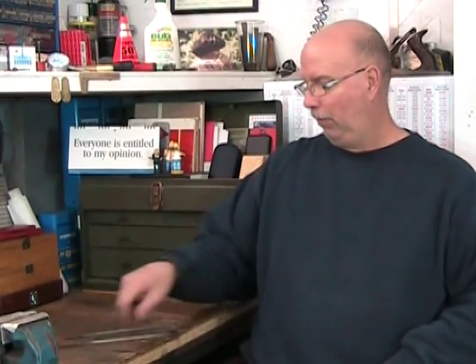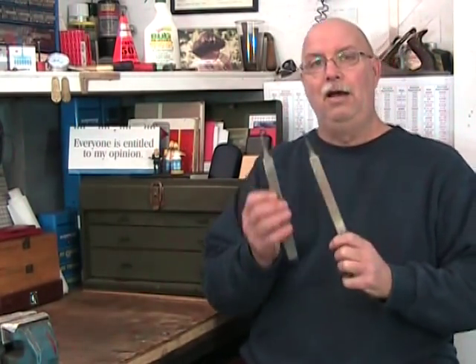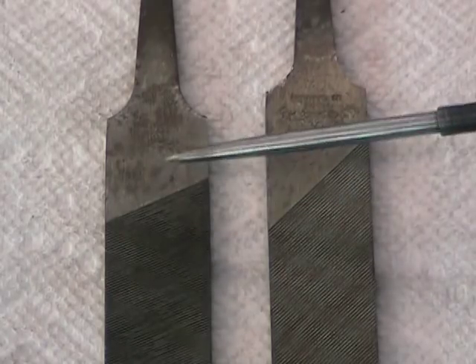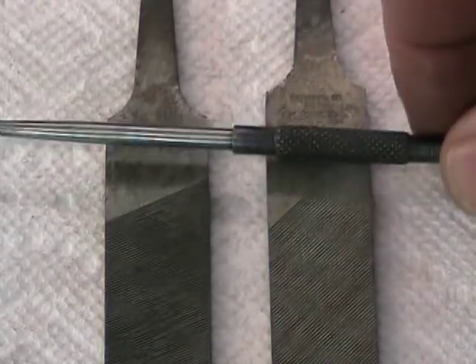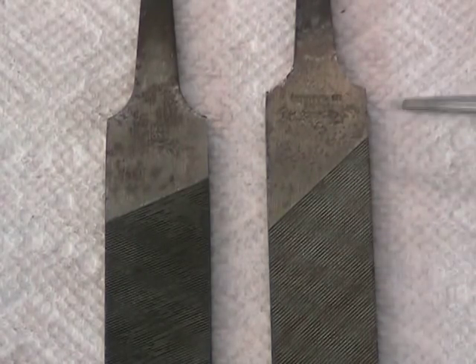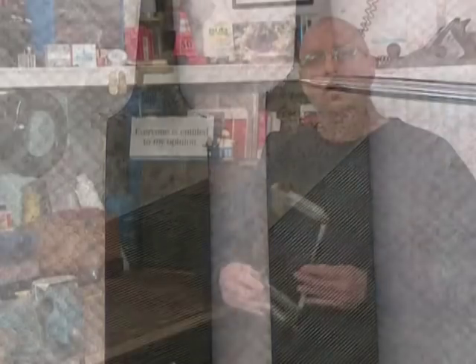Before we get to that, I found what I was looking for from my last video while rummaging through my old drawers to find tools for today's video. What I had been looking for was a lathe file. I found one here and another one — a regular file about the same size — so I'm going to put them down here so we can take a look at what that angular difference on the teeth actually looks like. Here we have a normal file for bench work with an inclination on our rows of teeth of approximately 30 degrees, and here we have a lathe file where the teeth are much more inclined — about 60 degrees — so this file will clear the chips much better.